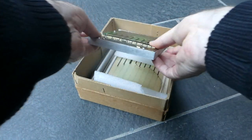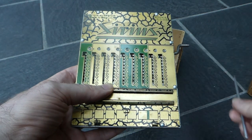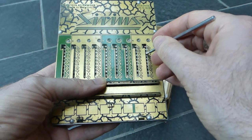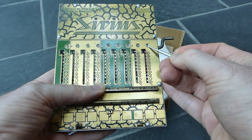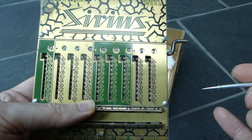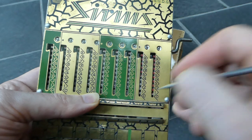In the box is the adding machine itself. It's a very standard slide adder. If you have a stylus — this is not an original one — you can enter a number by putting the stylus next to the digit you want to add and pulling it down. The digit is shown in this little window here. So I've now entered 57. To add 2 to this, you just put the stylus in the 2 and again pull down.